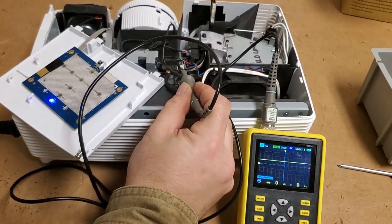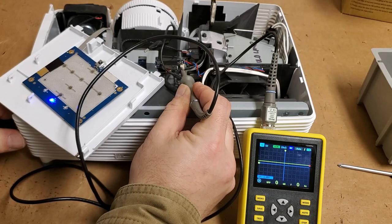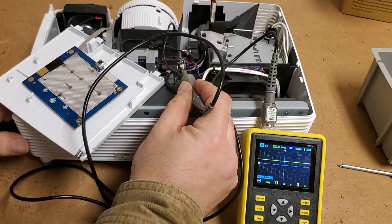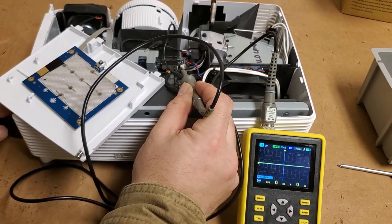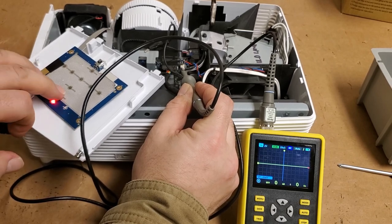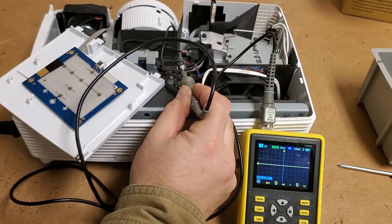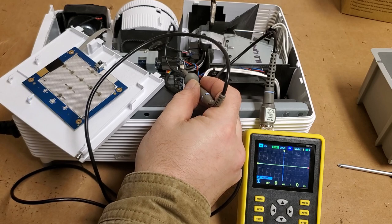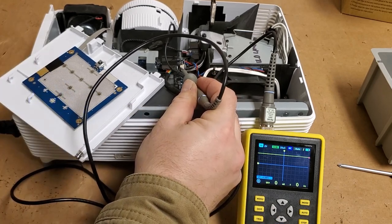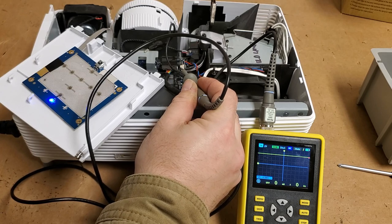Six. Oh. See, this is where I'm expecting to see a turn on right here. Back up and start it over. You go to a lower voltage. Go to the 2-volt scale. Yeah, that's so watch 4.8, and when it tries to start, when you hear the color wheel fire, we should see that voltage drop.